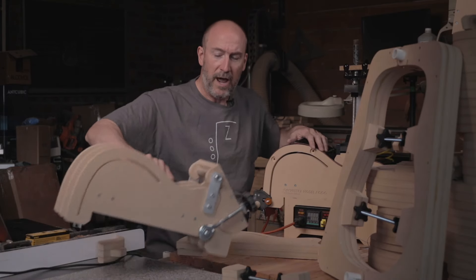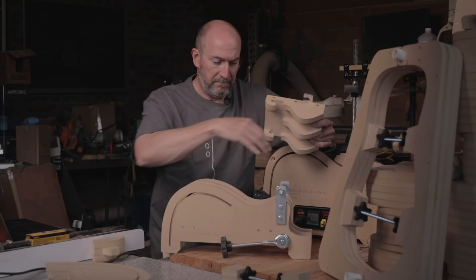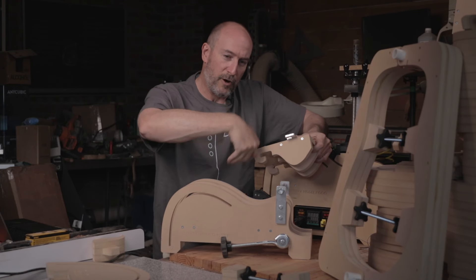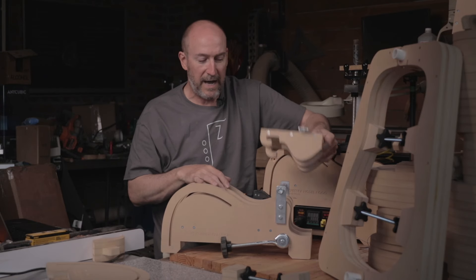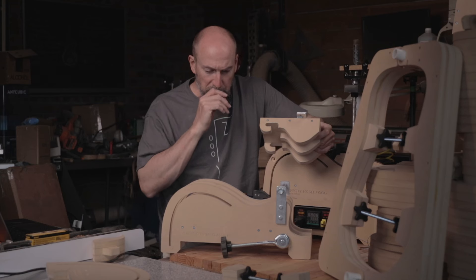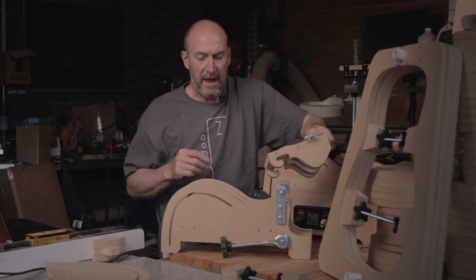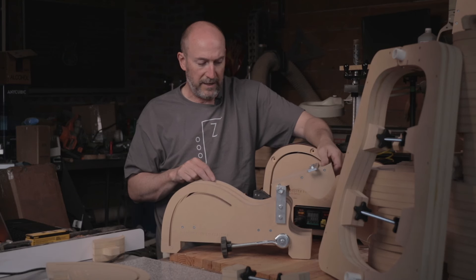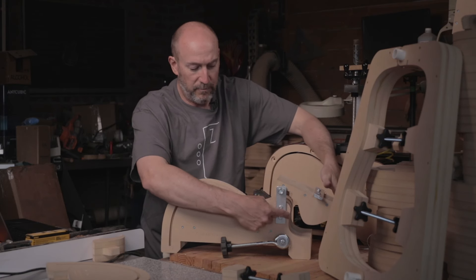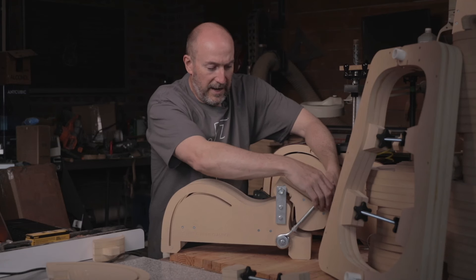Up here we have the Robert O'Brien classical in the cutaway version, so let's talk about the cutaway form and how it works. It's not the typical ram — that ram puts pressure kind of evenly all the way along the bend. In my mind it works a lot better to introduce the pressure along the length of the side rather than all at once in one spot. Essentially you put your side material in here — the sandwich, the blanket, the slats, and the side. We bring our waist press down until it's close but not snug, leaving maybe an eighth of an inch gap, then we hook on our cutaway bending form and let gravity press on it and start to form that upper bend.